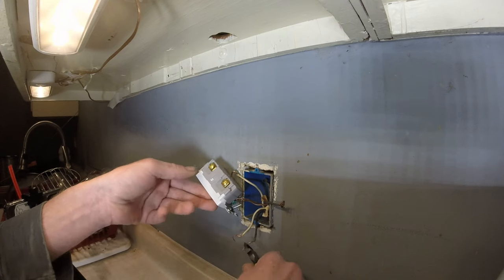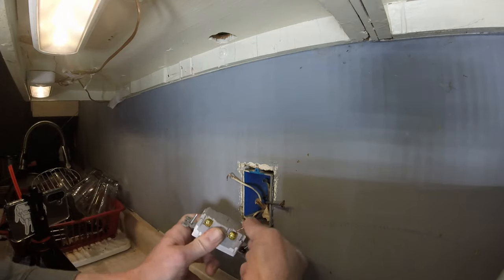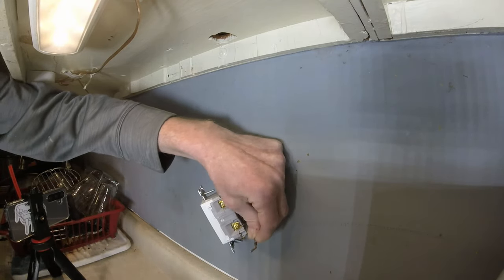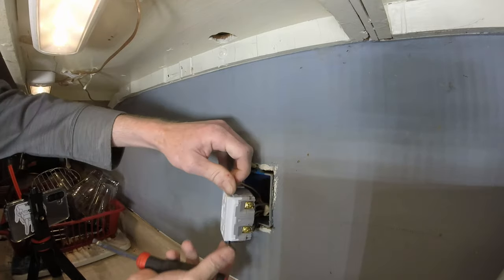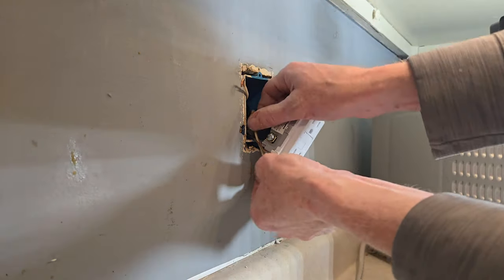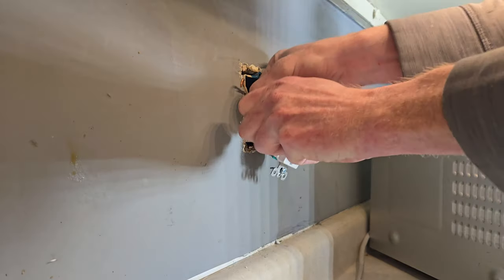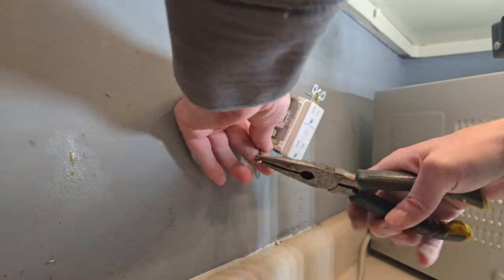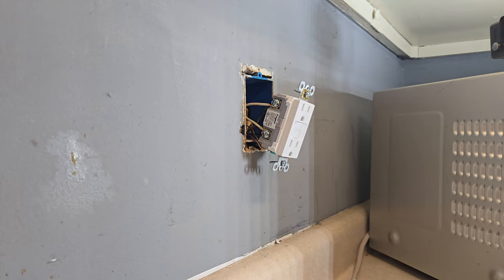Tighten this using the flat blade screwdriver — you just need them straightened out, nip a little of that excess off. The bottom wires go to the bottom terminals. Might as well do both on this side; straighten that, nip it down to size so both are connected. Now for the other side — I'm right-handed and I didn't like how they had the wire run so close to the grounds, so we're going to shorten that and put it further away. One more load wire to feed the other outlet goes up under the tab — all four are connected.